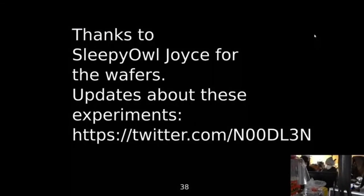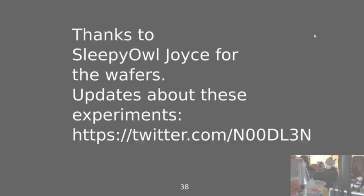There is another question that got in. Would it be possible to do those chips with gates and everything, or do you need other, more exotic stuff? Yeah, needed for that, which isn't available. If you want to build semiconductor chips with transistors, you need diffusion or ion implanting and such stuff. So it's much more complicated than only the lithography for the masks.